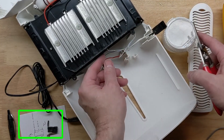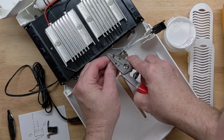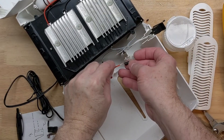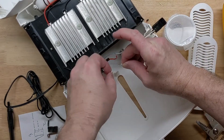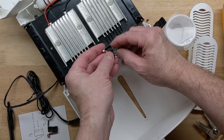I cut these wires at different lengths so I can write everything down and know exactly how it goes. I'll share a schematic a little later. I'm going to strip these wires back and get ready to replace. But I think I'm going to try to find some different switches, even though I already have a bunch of these, because I just don't think they're going to hold up. These are rated for 5 amps at 250 volts AC, and we know that DC takes a lot more to keep a switch functioning for a long life.